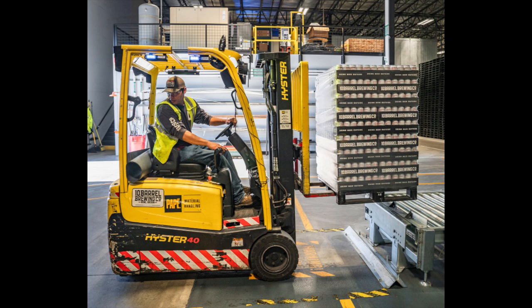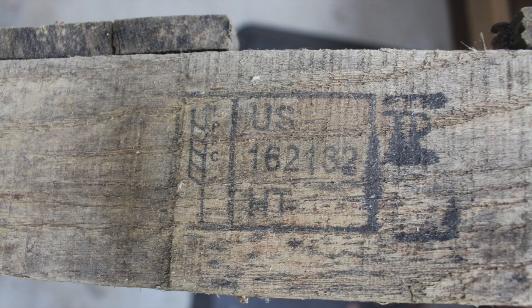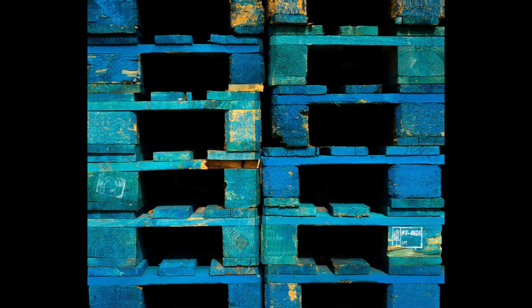Maybe even a friend — I had a neighbor who was giving me pallet boards pretty frequently. The other thing I would advise is to look for clean pallets. I would generally stay away from pallets from a chemical company or something like that. I try to look for ones that are heat treated and not chemical treated, and usually they do have a stamp on there that will tell you how the boards were treated. So check it out — you will find pallet boards all over the place, just remember to get permission.